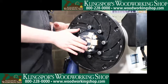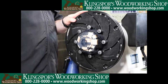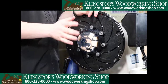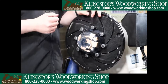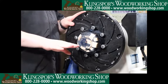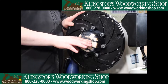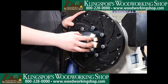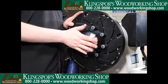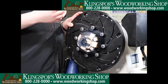On the back of the chuck there are a bunch of wing nuts and you just tighten those down all the way around. When you do that, these rubber feet will expand out and fill that extra void so this thing ain't going anywhere. You don't even have to hold with your tailstock. For a safety measure, I actually take the tool rest and place it about a sixteenth of an inch away from the bowl. That way, if this bowl ever decides to come out of the rubber feet, it just bounces off the tool rest and goes right back in — a self-taught trick.